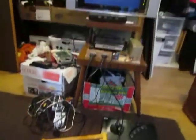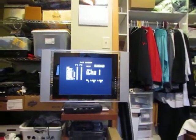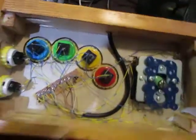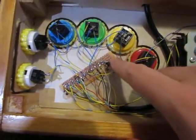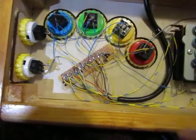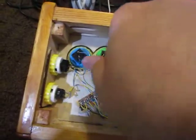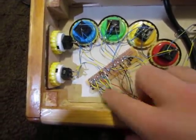Welcome to the lair where I'm working on my new controller. I just finished the wiring on this. As you can see, I've got it all wired up here. This is just a chunk of perfboard with wires from the cable going in and splitting out to everything else. I've got common ground running from this pin here, looping through and across all the buttons, and all the others are wired up individually to their respective pins.